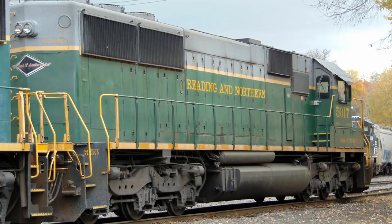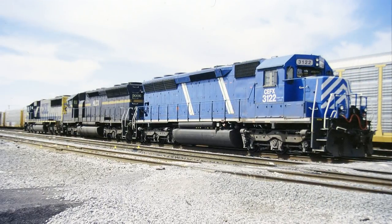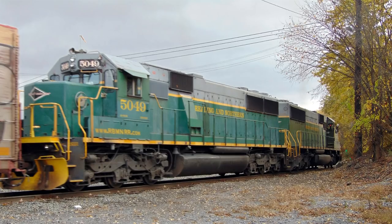Prior to the 60s, EMD developed the 50 Series four-axle and six-axle diesels in the mid to late 1970s into the early 1980s. The development of the 16-cylinder 50 and 60 Series locomotives was spurred by GE's Dash 7 line, particularly the 3,600 horsepower B36 and C36 Dash 7s. EMD had previously manufactured the 3,600 horsepower 20-cylinder SD45 and SD45-2. In 1980, the SD50 was added to the EMD catalog. EMD pushed the 645 prime mover to 3,500 and eventually 3,600 horsepower, with the extra power sent to new D87 traction motors boosting continuous ratings by more than 10% over the older D77s. But their electrical reliability was poor, and similarly, the 3,600 horsepower engine had poor mechanical reliability, believed to be mostly due to excessive vibration from the 950 RPMs of the 645F prime mover.